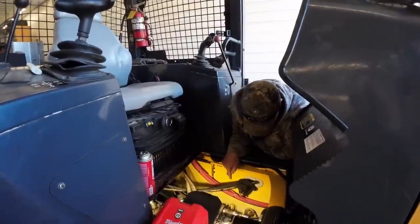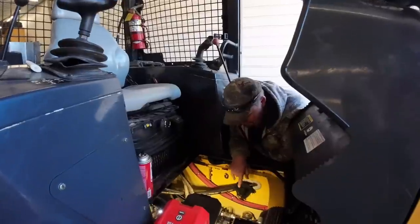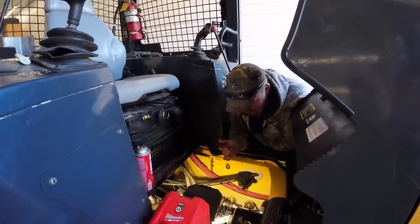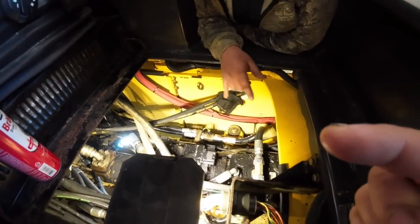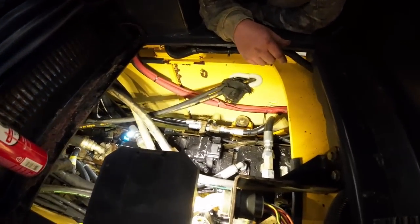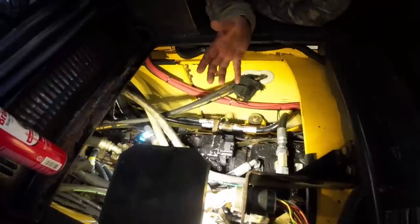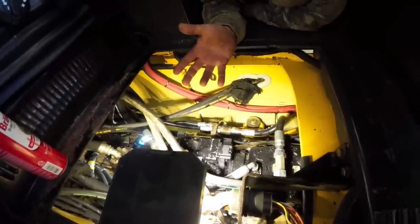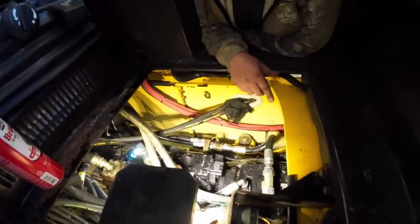I think we've got a, what do they call this? It's a bypass valve. It's a bypass valve for the oil cooler. It lets the oil go back to the tank to heat the oil up quicker, so the transmissions heat up quicker. There's a thermostat and a spring in there. So we're going to take that apart and see if there's something wrong in there. The guys at the pump shop said sometimes they see a restriction in the hose that causes that. That's the reason why we put new hoses on. I don't know. I've never run into this.